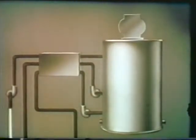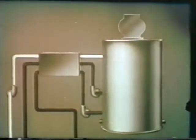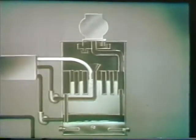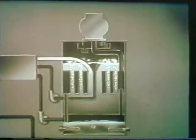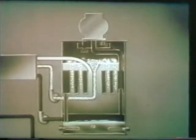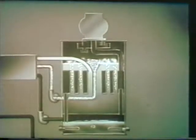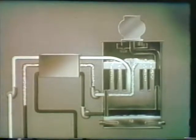Flow starts with seawater pumped through the heat exchanger into the evaporator. It pours through a downcomer, rises through tubes, where it comes to boiling and enters the top chamber. Here, the flow divides. Following one path, some of the boiling seawater spills into the brine overflow to carry away much of the scale-forming sea salts that otherwise would soon clog the evaporator. The hot brine flows through the heat exchanger and goes overboard.